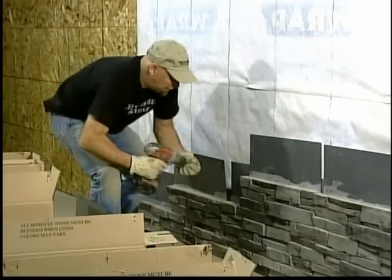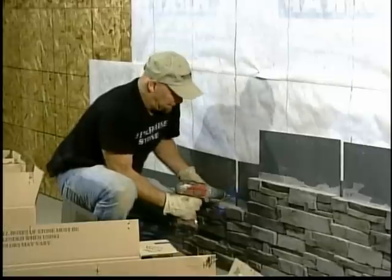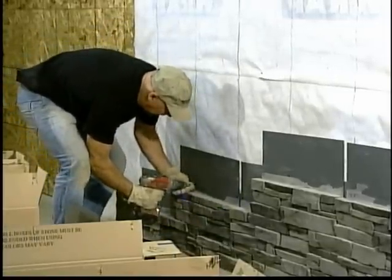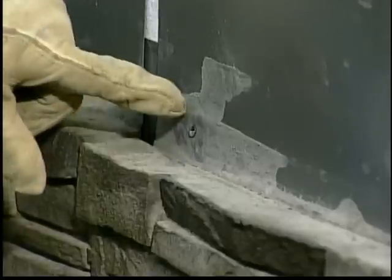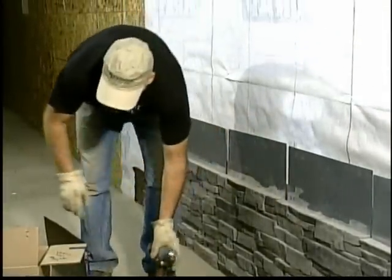We also recommend a stainless steel screw, especially for weather. To keep the waterproof effect, each screw must be up 1 inch above the stone into the flashing. If you screw too low into the flashing, you'll have a leak.